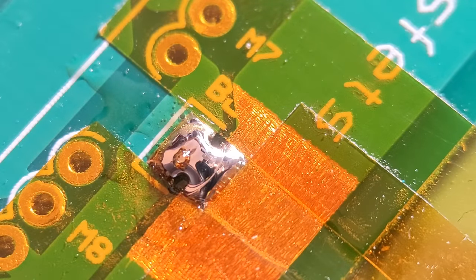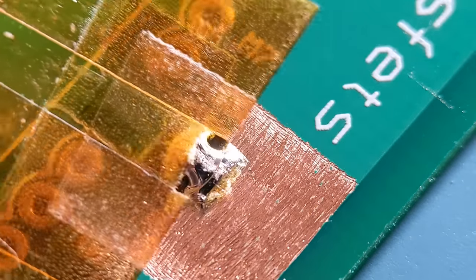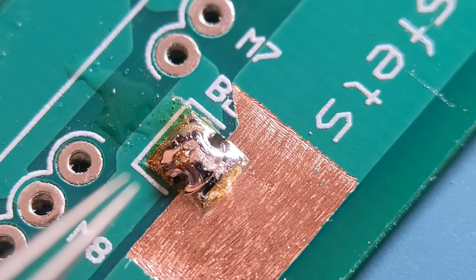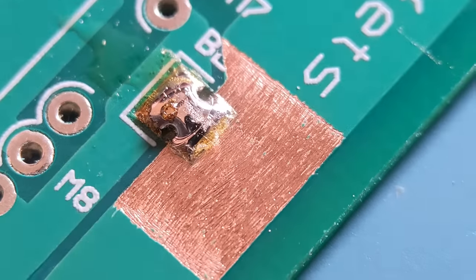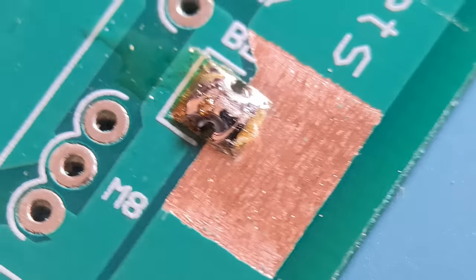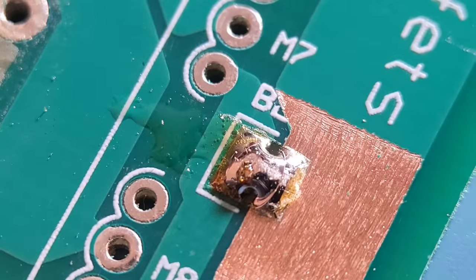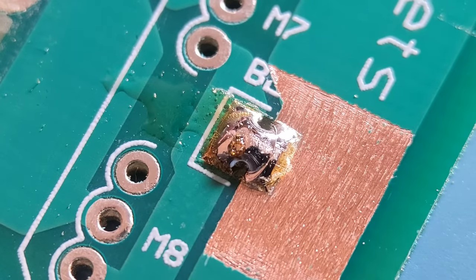So just add a blob on each pad, then try and join them together. There you go, you've got a nice blob over there — it's done its job. Now we peel the tape off and see the result. As you can see, I've got a lovely square joint right around the front — no flow going anywhere onto this unprotected trace. That's just flux you can see on top. It's actually a really good result. The Kapton does a great job in stopping the solder flowing to points you don't want it to.